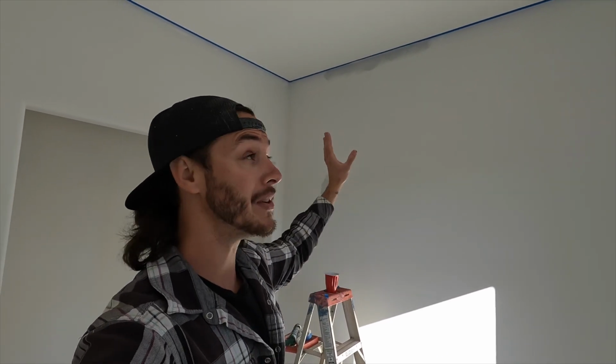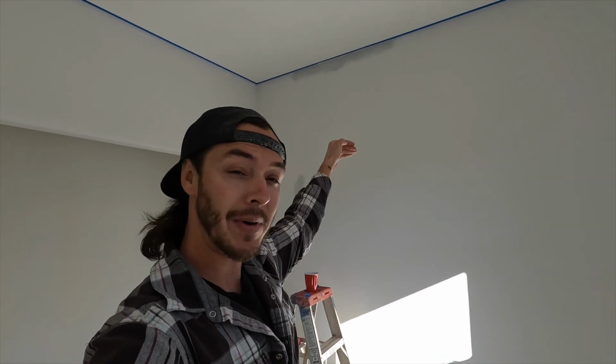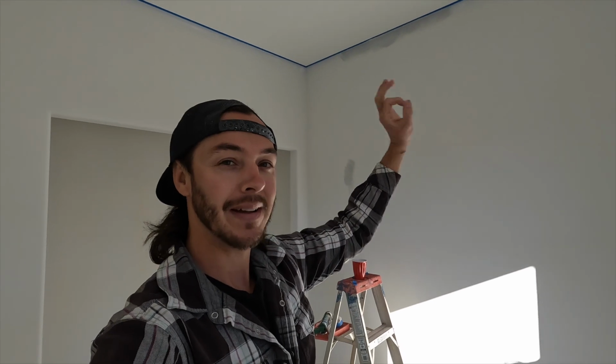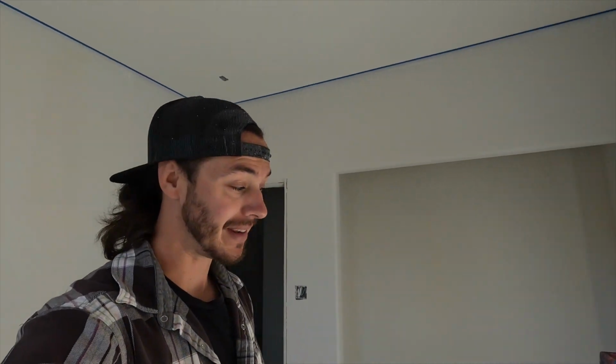And let's say the guy before you painted and got a little bit of paint on the ceiling. Well, if you're cutting in by hand, you're gonna stay on the wall, unless you wanna paint the ceiling like the guy before you did. But with the tape method, you can actually get that straight line to come onto the ceiling a little bit and go past where the old paint was, tape that, caulk it, repaint that whole line. Now granted, you're gonna be painting on the ceiling, but you're gonna have this long straight line on the ceiling and your eye is gonna think that's still a part of the wall. And you'll eliminate whoever painted before you's bad paint job on the ceiling, and you'll basically make a faux wall line. I don't really have a spot here to demonstrate that, but it works beautifully.